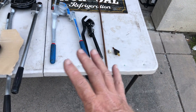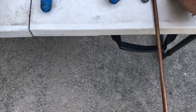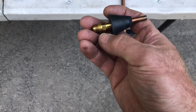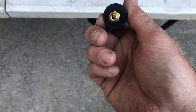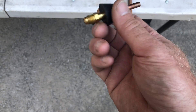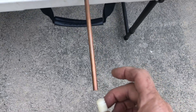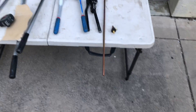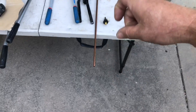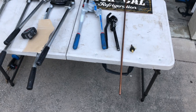Just for this video, I'm not going to purge nitrogen through here. But when you're annealing, you need to purge your nitrogen. There are different plugs available. This is just an A31004 access fitting — standard copper, quarter-inch access fitting. You can get some plugs; the pipe will come with plugs in it. I've drilled holes through these to put the access fitting through — anything to get a plug to get your fitting in there to get your nitrogen purging while you're annealing it. After it's annealed, then you're good to go. Another thing you'll want as you anneal it: get some wet rags. After you've got it all hot and annealed, you can cool it down so you can get to working faster.